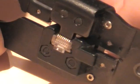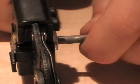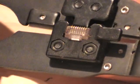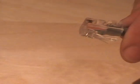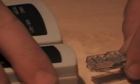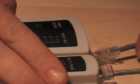So I'm going to put that inside my crimp tool, roll it over, and have a look down the end of the plug to make sure that I can see a good reflection on the end of the copper. Give a good push in and a waggle, and then once I'm happy with it, give it a squeeze. And again, just release the tab very slightly. At this point, I can take my cable and put it into my cable tester, and hopefully this cable will test.